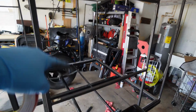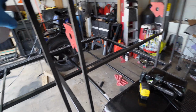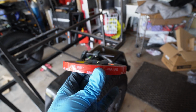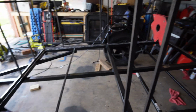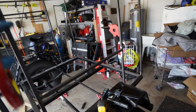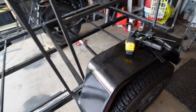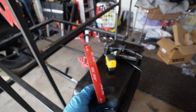Now with our windows basically laid out, done, we now get to start on the next thing, which is grinding slash cleaning all the walls. So how we're gonna mount our walls is with this VHB tape, because it works really well and it's easy to apply. So I'm gonna grind away just all this mill scale here on all the outside walls, and we're gonna lay this down on clean bare metal, and then we can come back and spray paint over it. So like I said, none of this metal is going to be exposed to the elements, so it's not crucial we get a huge good paint job on it like we did with these, because these are looking really good. But that's going to take a bit, and it's not going to be very exciting to watch. So let me do that real quick.